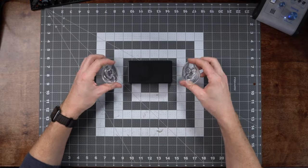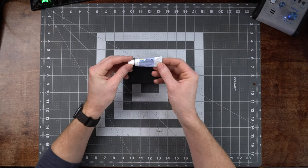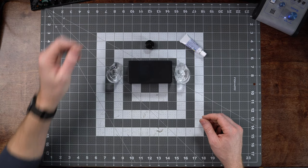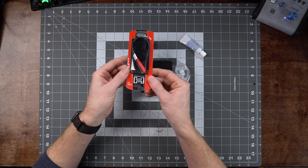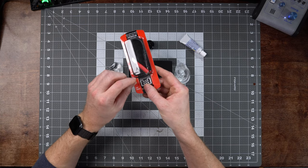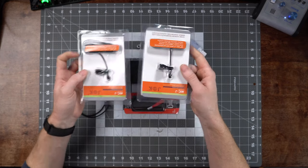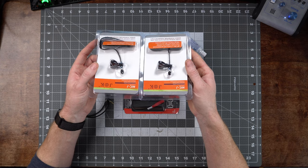You're going to need two silicone ears. I'm using something called Silpoxy by Smooth-On, but pretty much any silicone-type glue will work — you do want it to be silicone-based. You'll need a quarter-20 to cold shoe adapter, and this Hosa splitter which brings left and right channels together into the proper channels in your camera. You'll need a washer and a nylon quarter-20 locking nut, a short six to twelve inch headphone cable, and then two of these MikeJ lavalier microphones — they're inexpensive and sound really good. Shout out to Curtis Judge for turning me on to those.